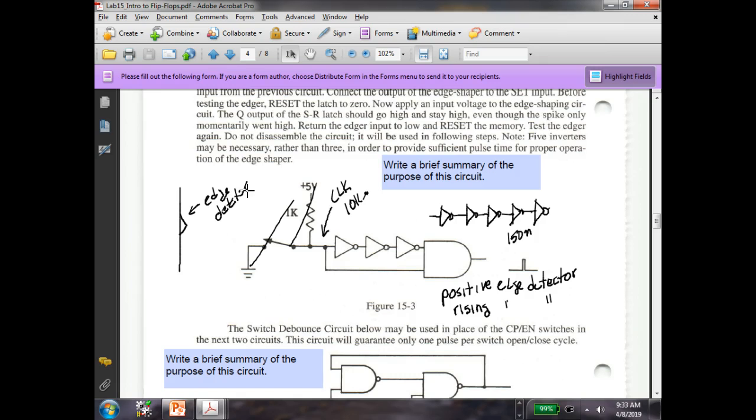So we're using 7411, which is a 3-input AND gate. I don't know why they did that. So what I have is two of them connected together. This is one, this is two, this is 13, and this is 12. And of course, power, it's a 14-pin DIP. So 14 is VCC, and 7 is COM.